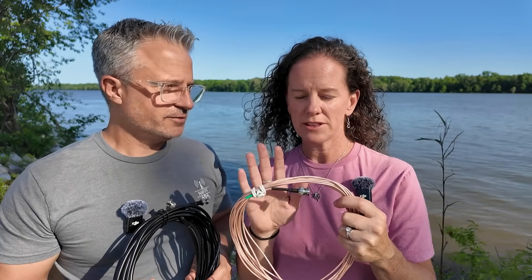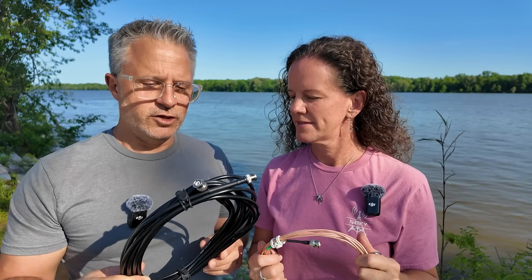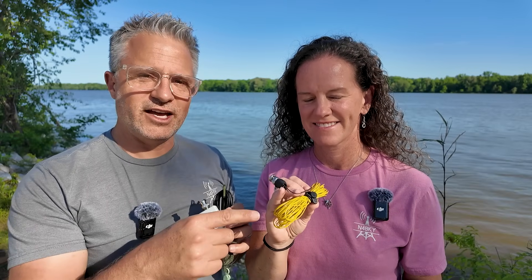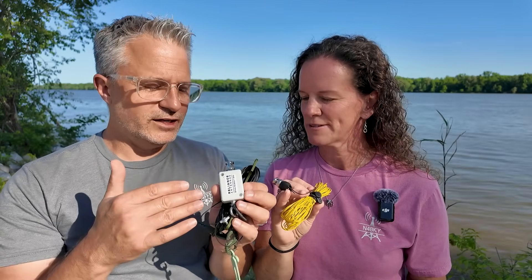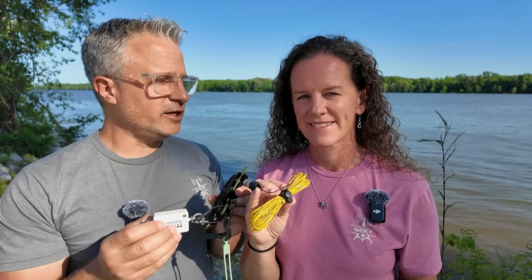These are measured in loss per foot. This coax is 25 feet, and knowing it's loss per foot, 25 feet gives us a lot of flexibility to figure out where we want to be compared to where we want the antenna to be — like being able to get the antenna further away from a camper — but not so long that we have a ton of loss. But what's the best length possible? Zero feet. We've had a ton of luck with our K6ARK plugging directly into the radio — no coax loss at all — and the Reliance Antenna we've been using also gives fantastic results. The advantage of no coax is no extra loss. The disadvantage is you have to be exactly at the right spot, so we put the antenna up first and then set up our portable table at the right spot.